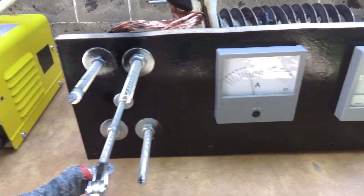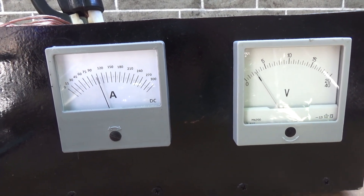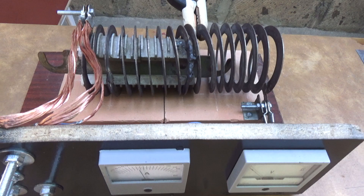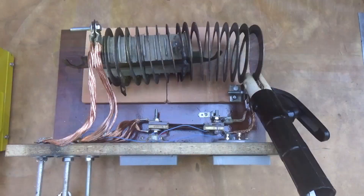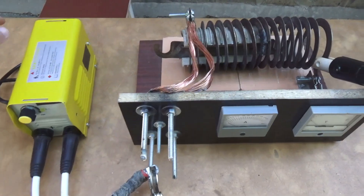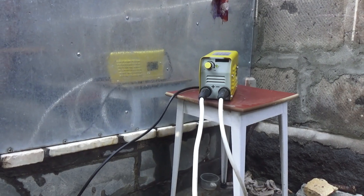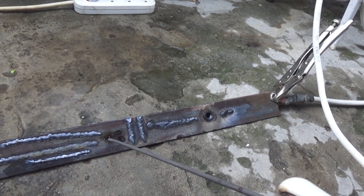Now the regulator is at maximum. As you can see, the maximum current value is 100 amps — this is the honest maximum output current. I tried up to 120 amps and an output voltage drawdown to 15 volts was formed, making it almost impossible to weld at those parameters. To check the anti-stick function, I closed the inverter output through an ammeter bypassing the ballast resistance. As you can see, the maximum current is 125 amps. There is no anti-stick function, and here is a confirmation of that in practice.